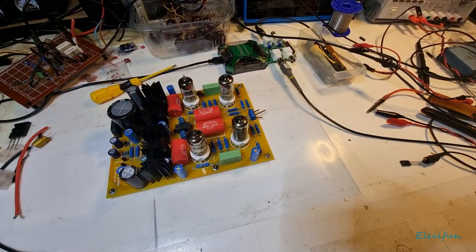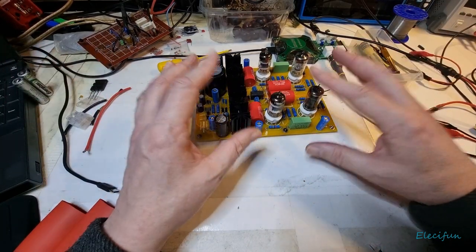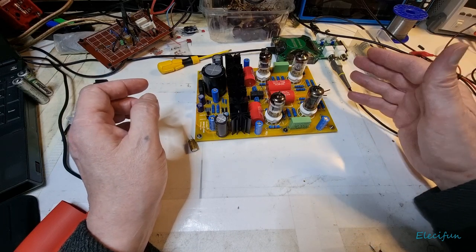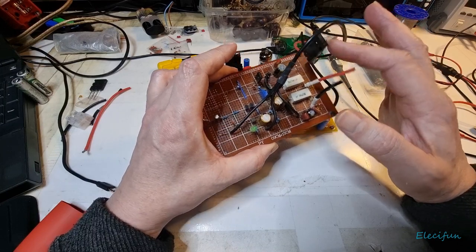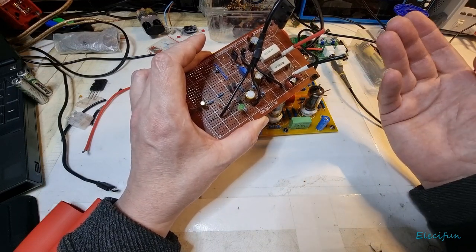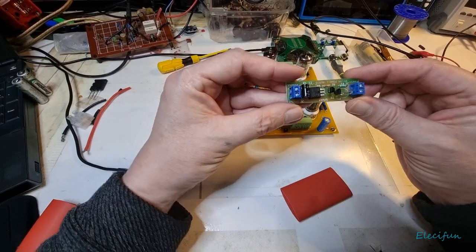So I've got to get another one of these to fix that unit. What did I learn from it? I learned I've got to be careful especially when things are plugged in and running — this is pretty high gain, you can get 15 volts out of this thing. With crackling connections that's no good. These are not genuine components; they're just bought off eBay. What I found with some eBay stuff is that the genuine LM1875s have short-circuit protection, but the eBay ones don't — maybe because that's patented, I don't know.